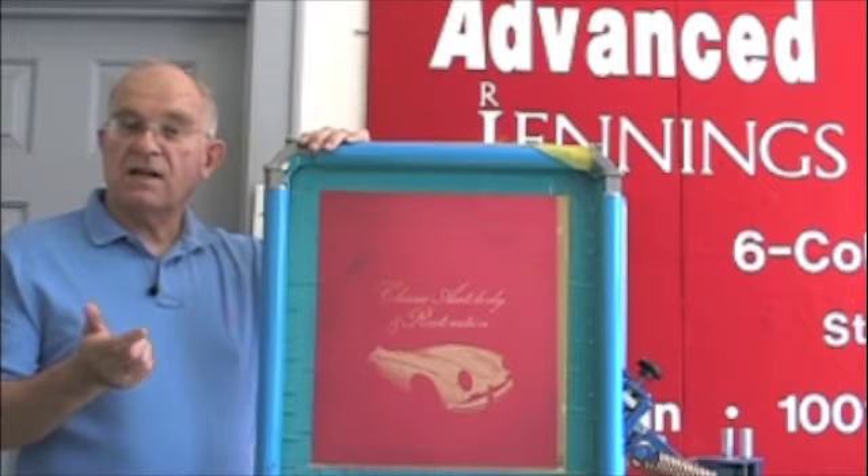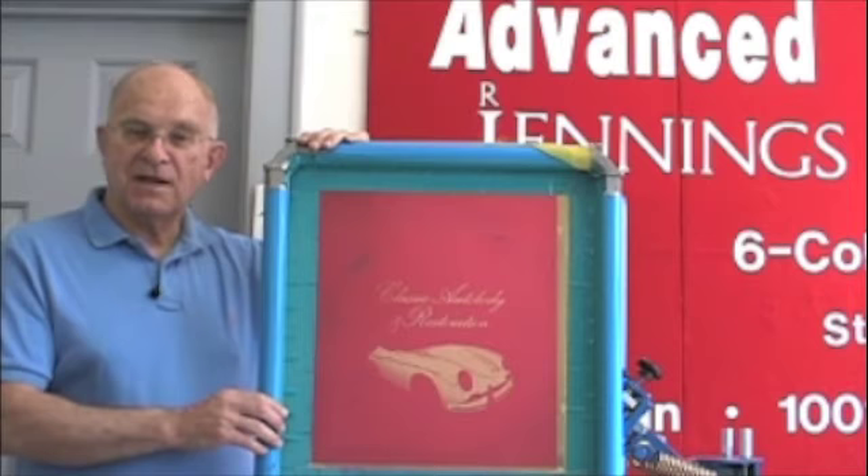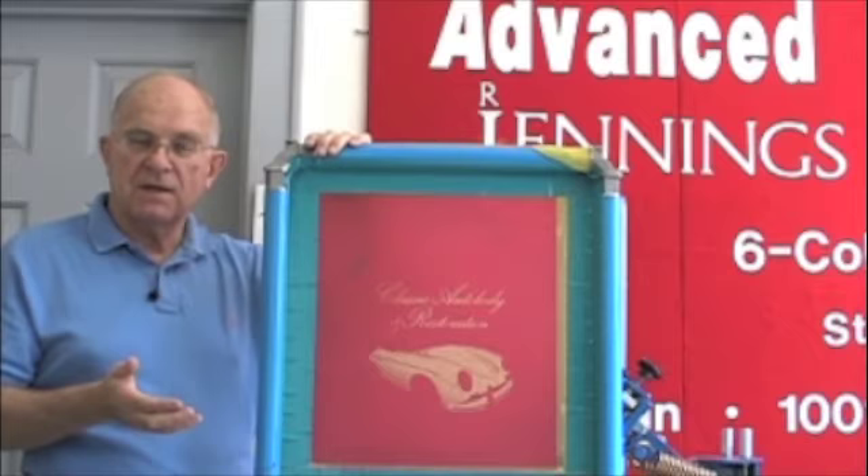In fact, you raise the tension to an even higher level than it was before. Wait four hours and you're going to lose another 15%. Same story — put the wrench on there, recover the lost tension, and raise it to an even higher level. By the next day, you will have lost only 5%. So you're losing less and less tension over time.